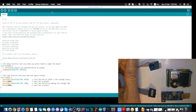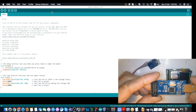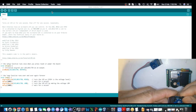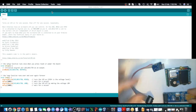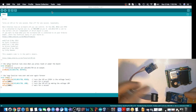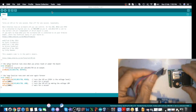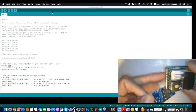Now we're going to load the bootloader. Before we do that, we need to make sure we got the USBasp, the one that has the modification for 3V. Make sure we jump the jumper to the 3V selection. Otherwise, it could burn the serial flash. So double check that. And then we insert our special made cable for this Arduboy homemade package. Insert it to the USBasp. Insert the other end to the expansion pin here.